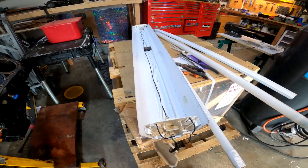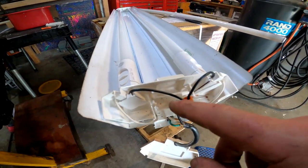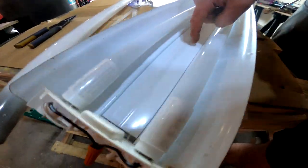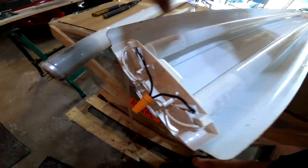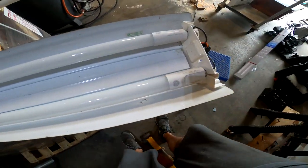I've got the ballast out and wire nuts connecting all three wires together on this side, and the same on the other side. There's a wire that runs all the way in the middle — wire nut all three of those together. Then install the bulbs; these install the exact same way the old fluorescent type do.